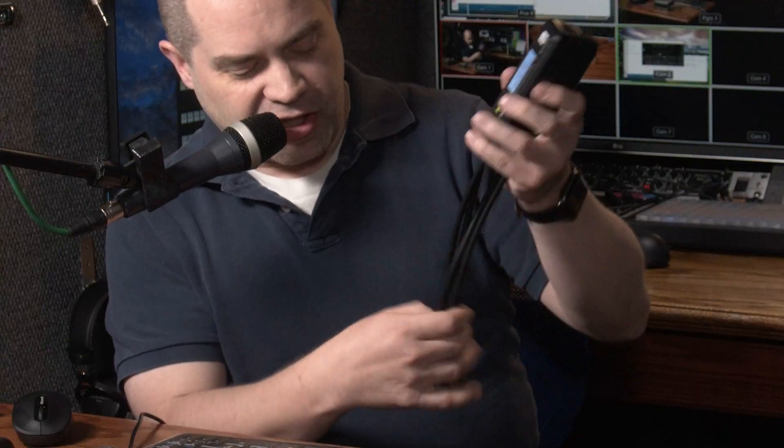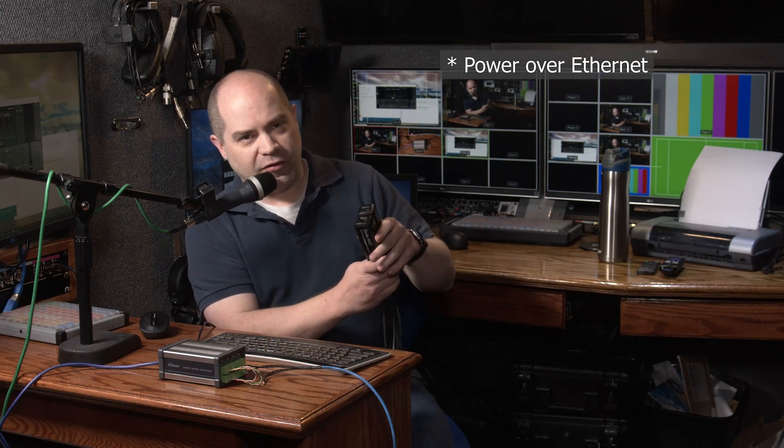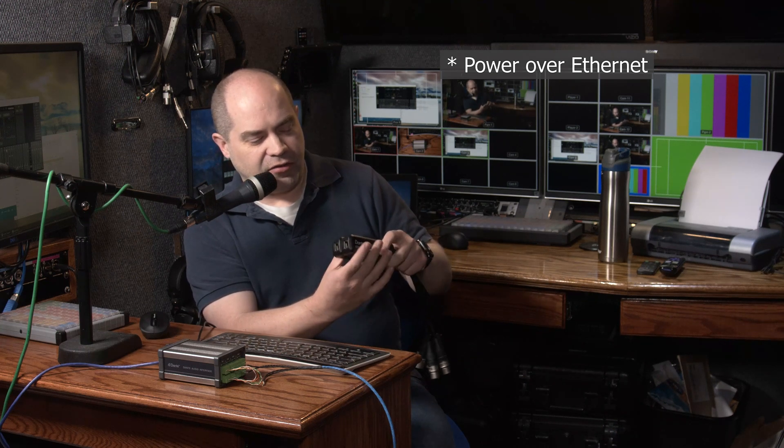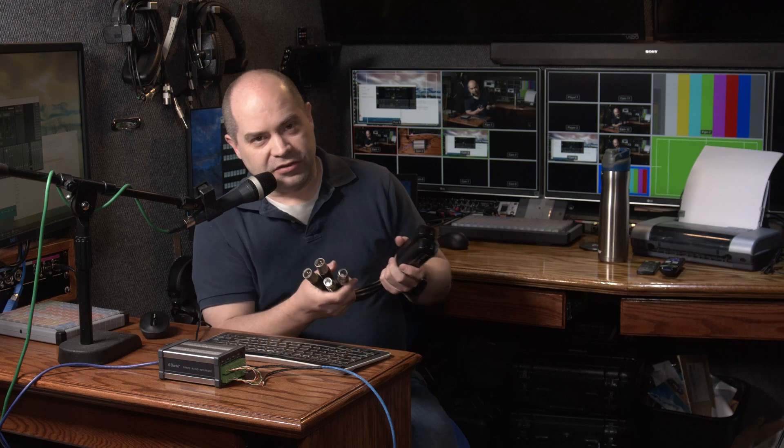Because of the audio dropping out, it's unreliable, and there are better ways to spend your money. What I would recommend for someone looking for something in this price range is using the AVIO adapters from Audinate themselves. I've got a couple here — this one is two-channel analog input and this one is two-channel analog output. The downside is they require Power over Ethernet from your network switch to operate — they don't have a power supply. You'll need a PoE switch or a PoE injector. The price per channel is higher: these units are about $129 each, so four channels in and out would require four units — around $600 versus the $199 of this unit.